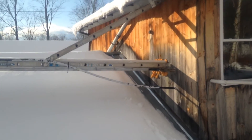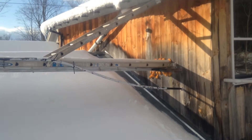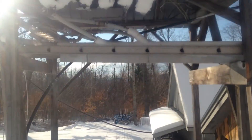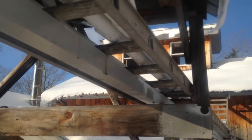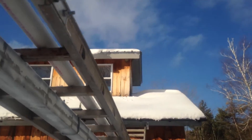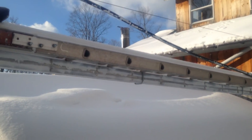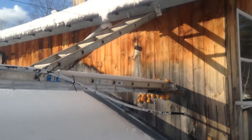Let's take a walk outside down the ramp. We needed something to hold these pipes up from where they come into the building to the insulated area. There used to be a big three-and-a-half-inch aluminum box steel piece, but I had to spread the load because we have four two-inch pipes coming out here. I thought about wood and other options, but I wanted something light, rigid, and straight. Then I thought — a ladder would work really well.